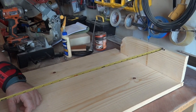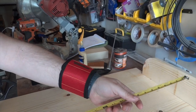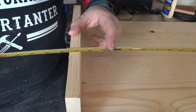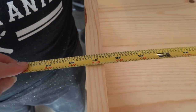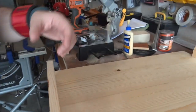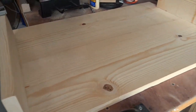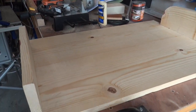When you measure the inside, you butt this part of the measuring tape on one side and then read the inside of the other side. In our case that's 26 and just a hair under five-eighths. This is a very technical term — just a hair under five-eighths. Cutting it a little proud and then slowly edging it to where you want is the best approach, because if you cut it too short there's nothing you can do, but if you cut it too long you can always fix it.